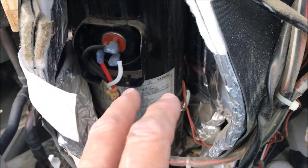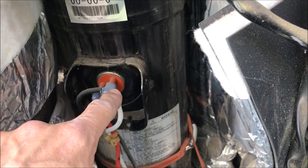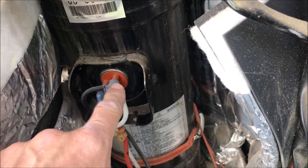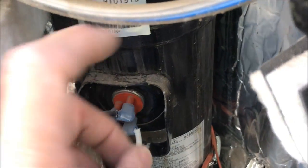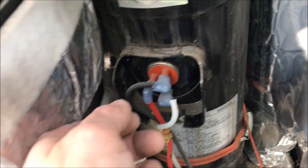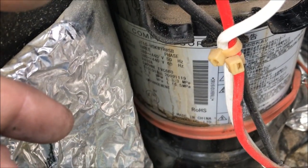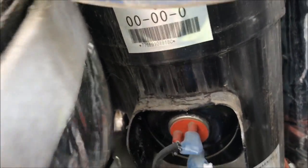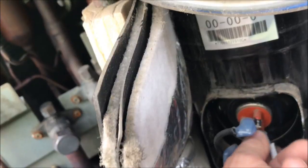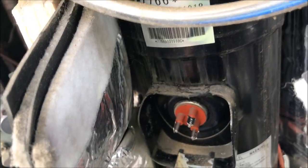Even though you're not checking the other unit's inverter, once the power is off on both units, you can't see the other disconnect from here, but there is a slight voltage on these things, not a lot, but you have to kill the power in order to take these off. You're going to get shocked. You can use insulated tools and all that, but it's just not worth messing with. Always look at your wiring, your V, W and U, and correlate the colors to which one's which. But you have to take them off the inverter when you're testing the other one, because it sends voltage through both boards, and they have to be disconnected.